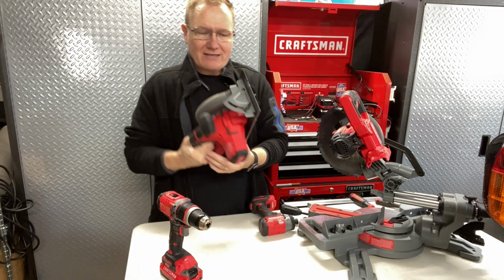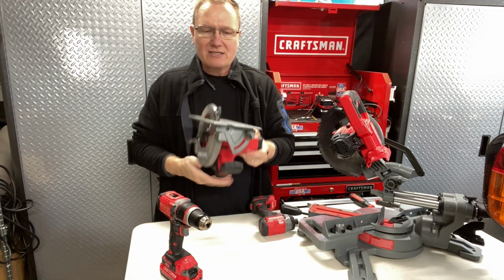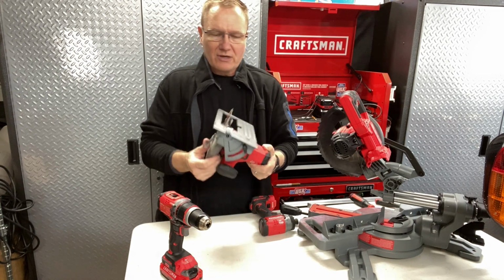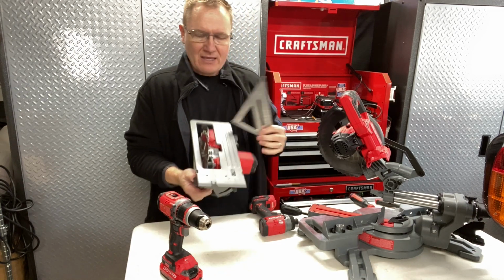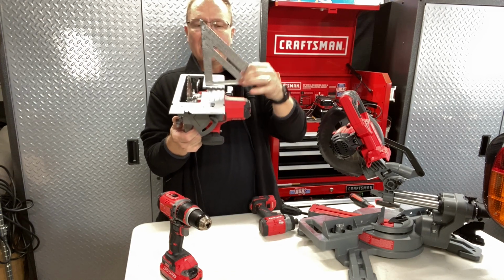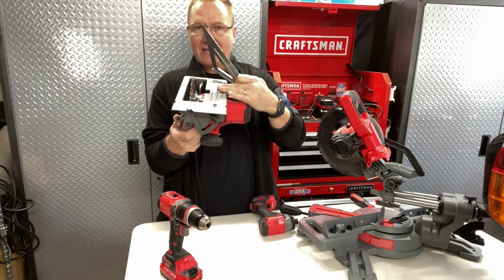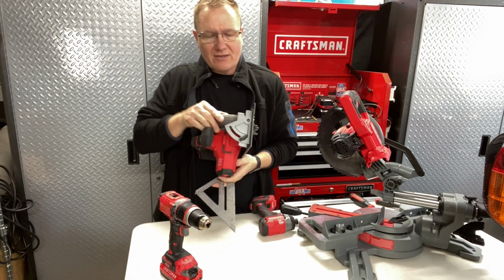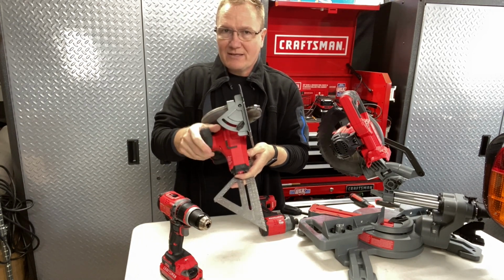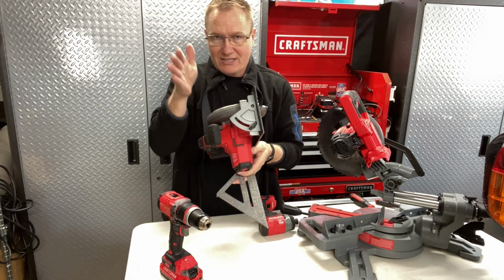This is a great second tool, but one thing I would recommend, no battery by the way, is when you're working with tools and saws, take a moment to check and make sure that the blade is square with the bed as you're going across. You'll see that there is a little gauge right here in the front that allows you to tip it and adjust for angles.